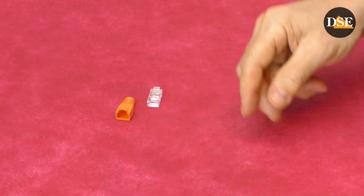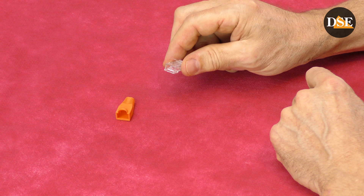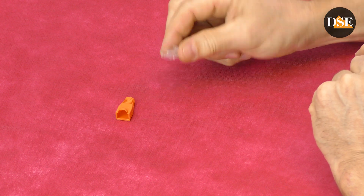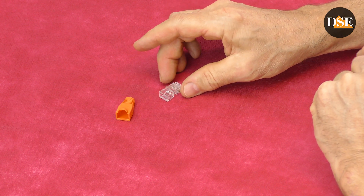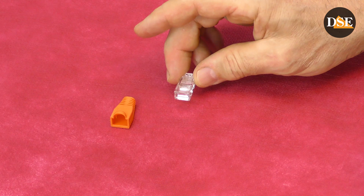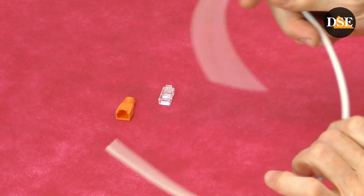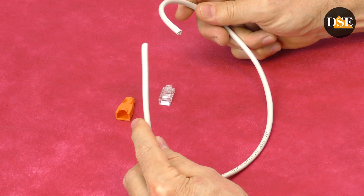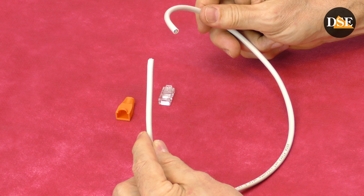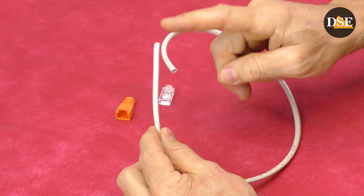In this tutorial I am using pass-through connectors. Most tutorials you will find on this subject on the web refer to the standard RJ45 plug. In my opinion, these new generation plugs will soon replace the standard one because this connector provides so many benefits in terms of easy crimping and safe connection. So let's start — I'm taking a Cat5e cable, the standard and most common cable for IP cameras. Now I am going step by step to show you how to crimp the connector on the top of this wire.